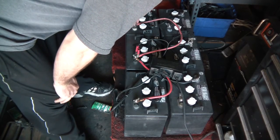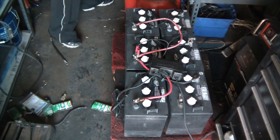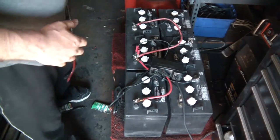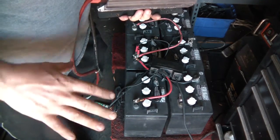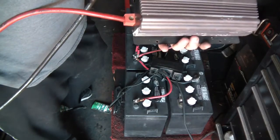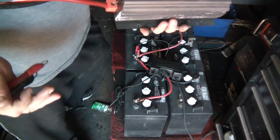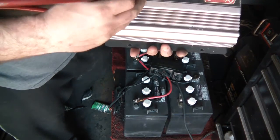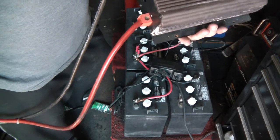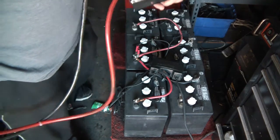I have this to run my inverter so in case of a power outage I can run my 12 volt accessories directly off the batteries. I purposely got 12 volt camping accessories so I can run a campsite without using an inverter — direct connection without conversion. This is my 1200 watt inverter; it's not powerful enough to run a refrigerator, so I really just have it for computers, radios, and emergency gear.